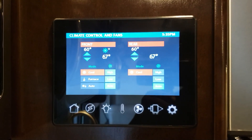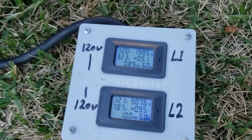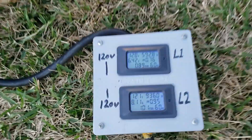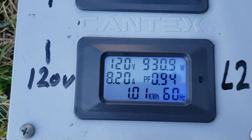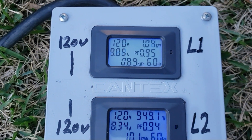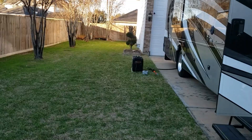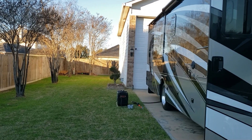There's one AC — come on. Remember, we can pull 20.8 amps on each leg. We're right at about 50 percent — about 1,000 watts on this leg and almost 1,000 on the other. Let's get a dB test at about 50 percent: 62.1 dB.